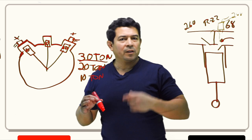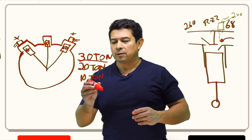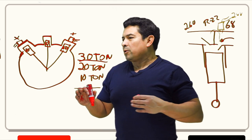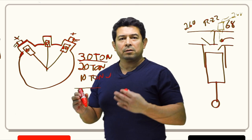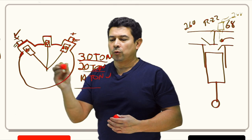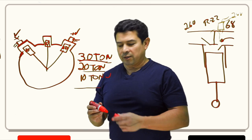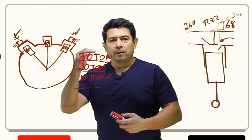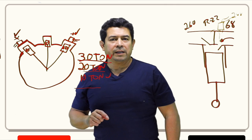We're running at 10 tons. The room empties, the heat load drops further, and we cut it off completely — shut the motor off, pistons stop. The temperature goes up in the room, and we start it back up at 10 tons. More people come in, we load the second head — now 20 tons. More people come in, we load the third head and we're back to 30 tons of cooling. As heat load increases or decreases, we can run this as a 30-, 20-, or 10-ton compressor.